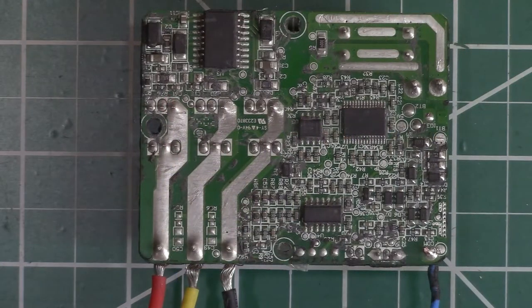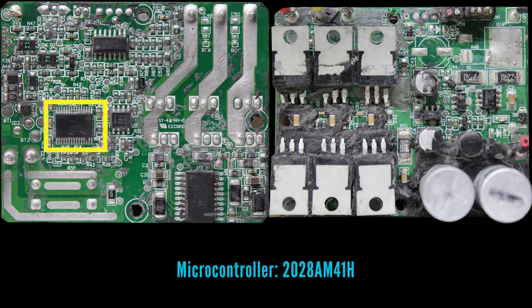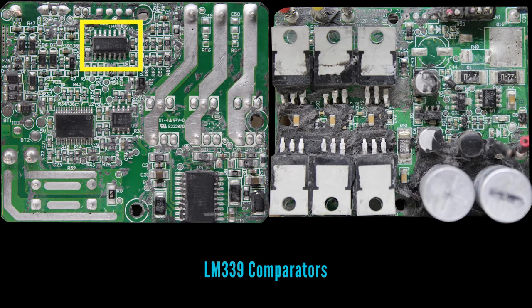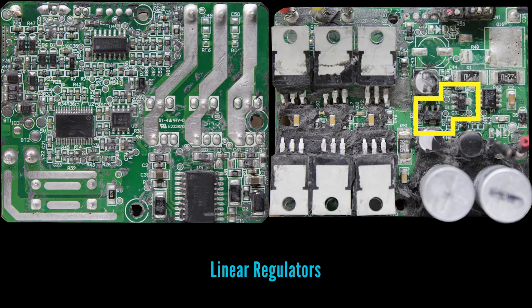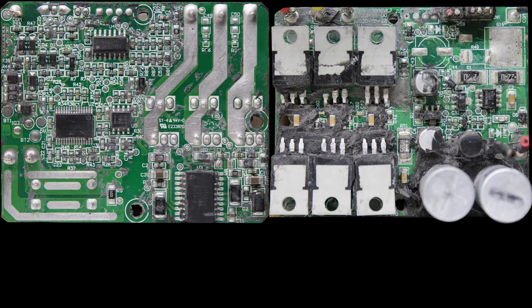But once removed, we get to see what components have been chosen to drive the three-phase BLDC motor within this garden tool. As expected from pretty much any three-phase BLDC motor application running sensorless back-EMF algorithms, I was sure to find: a microcontroller to run the code in charge of generating the tri-phase revolving magnetic field, as well as applying all sorts of controls; a gate driver to effectively power the six power switches and turn them on and off in a timely fashion — remember, a microcontroller GPIO is not strong enough to perform this action; a differential amplifier to measure the motor current; three-phase comparators to extract the rotor position; multiple linear regulators to generate step-down voltages; and six N-channel TO-220 MOSFETs to function as the three-phase power stage.